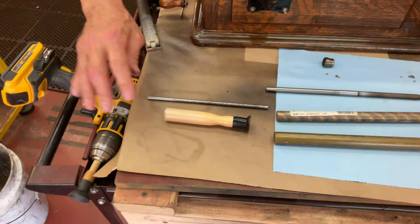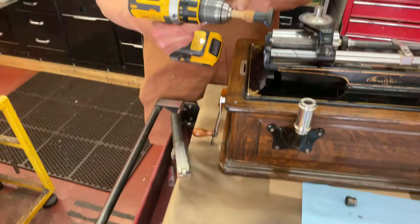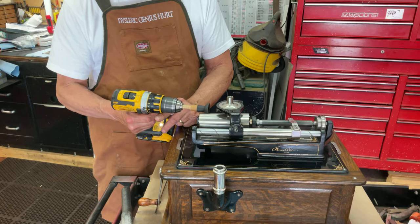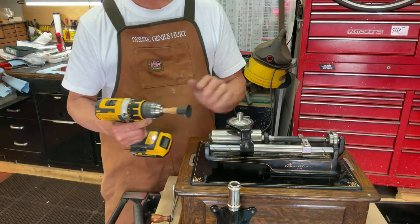I took one, I machined it down, I hook it to my drill. How do you hook it to the drill? I machined the end down, or you can grind it down just as long as you can get it in your drill. I put the machine into 2-minute, I assemble everything, and then you stand here like this — it's called running the bearing in. What you're doing is you're lapping the shaft and the bearing together so they run freely.